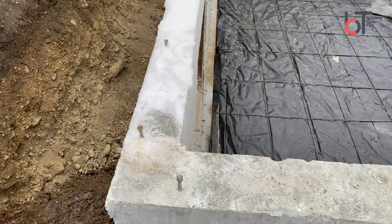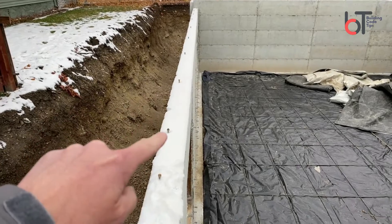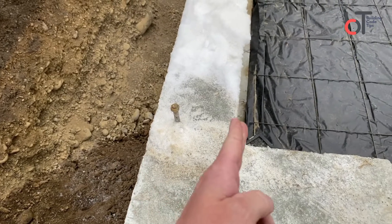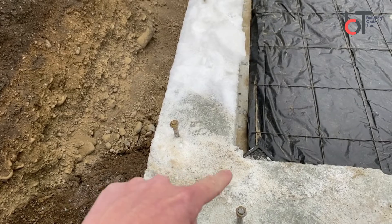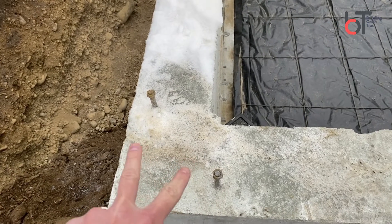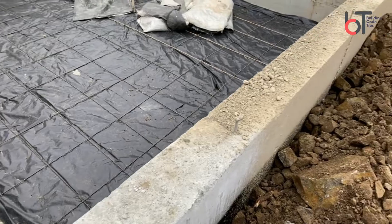Let's take a peek. You can see this foundation wall with all these anchor bolts — they're actually about four feet on center. Right here you've got a corner, which means you'd end up with a break in your bottom plate. No matter which way it breaks, you're going to end up with one of these bolts on either board, and it's going to be within 12 inches of the plate break. That's great.